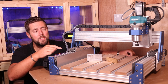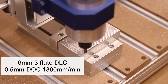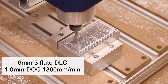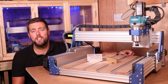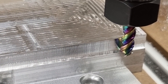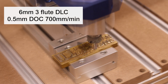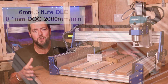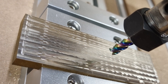How does it fare against metal? I did some tests on aluminium and brass. I started by surfacing an aluminium block, taking the depth per pass progressively deeper. I got it cutting at one millimeter per pass, which was a little aggressive, but it was comfortably machining at 0.8 millimeters per pass. I also tested facing the side of the aluminium at a depth of eight millimeters per pass — the results speak for themselves. I then switched to brass, surfacing off an old branding iron and taking it back down to a flat bar. These setups aren't designed for machining metal 100% of the time, but I was really impressed with the speeds and depth of cut, as well as the nice finishes achieved.